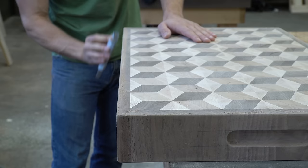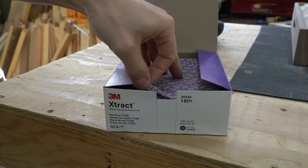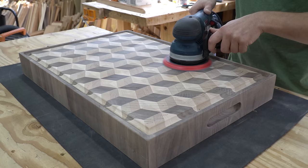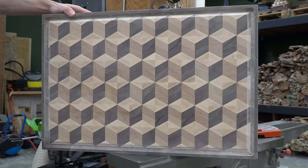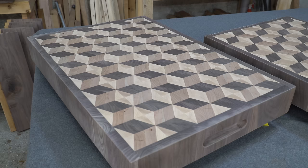I put all the boards through the same grit progression when sanding. After 80 grit in the belt sander, I go through 120, 180, 220, 320, and finish with 400, which polishes the board to a glass-like finish. I also raise the grain with water between each grit. The last thing I do is remove any residual sanding dust with compressed air, and then on to what most would say is the best part. There's a link to the oil I used in the description if you're curious.